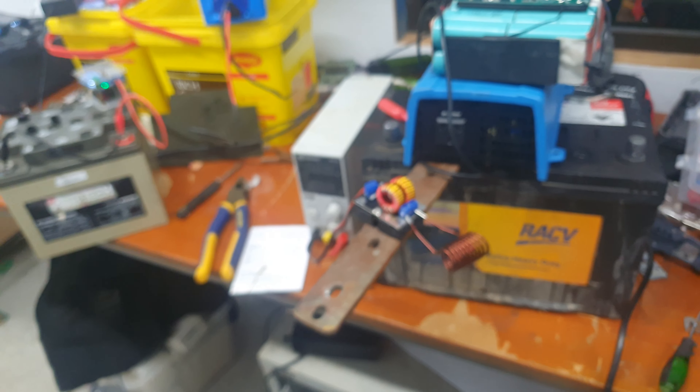Sometimes if the coils are too close together they can create a bit of excess draw. But that is awesome - I'm gonna buy a big one! Stay tuned, we're gonna buy a big one. This will be linked in the video description. That's not the tiniest of screwdrivers - must be more than an eighth of an inch, three and a half mil, something like that on the end of it. For like 60 watts of energy it just melted the end of that screwdriver. Pretty mad mini ZVS - supposedly you can put as little as 5 volts in this, which is craziness. Anyway, thanks for watching, catch you in the next vid.